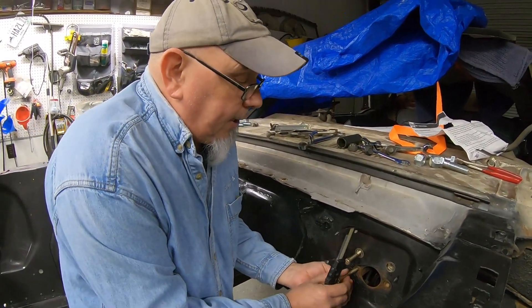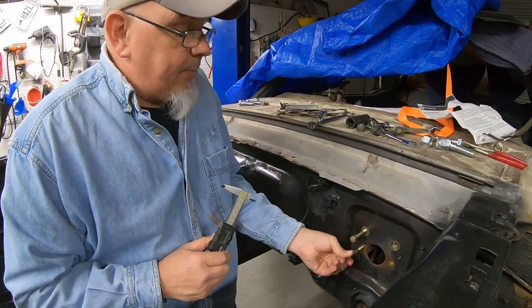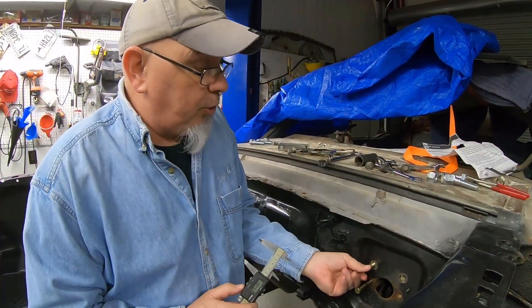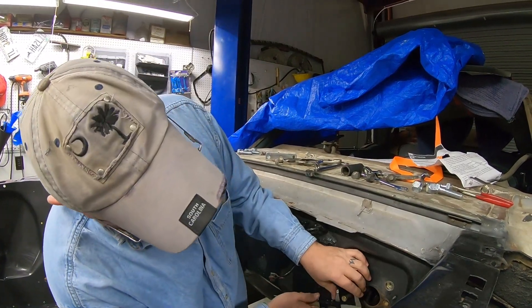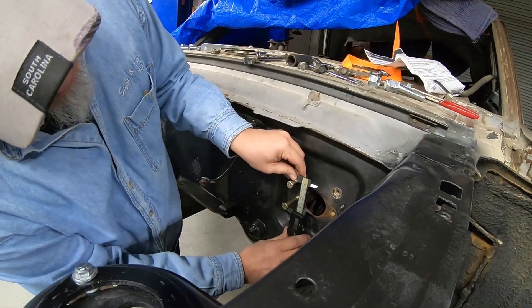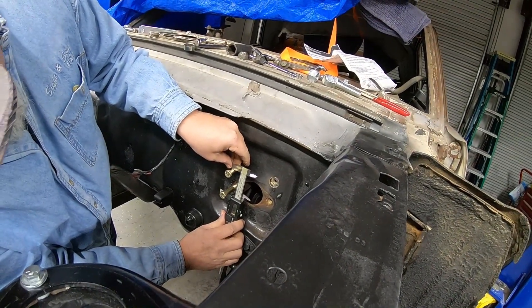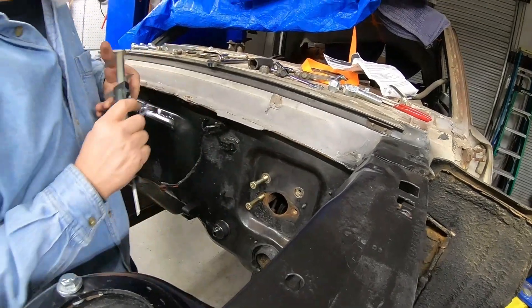So what we'll try to do now is the same thing — we'll just run the bolt in there. Now we're going to pick up off the shoulder of this bolt and zero that. We're going to zero again and measure here: 46 — let's just say 46.3 millimeters.